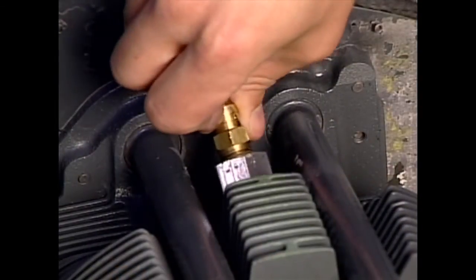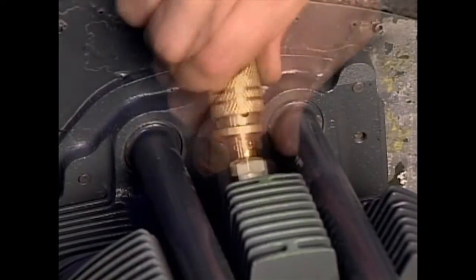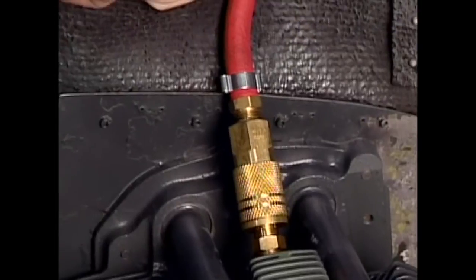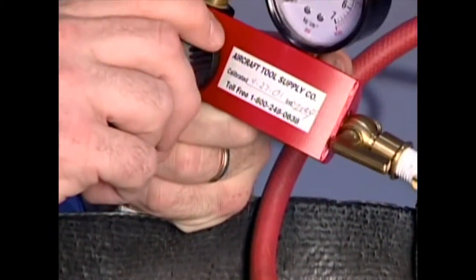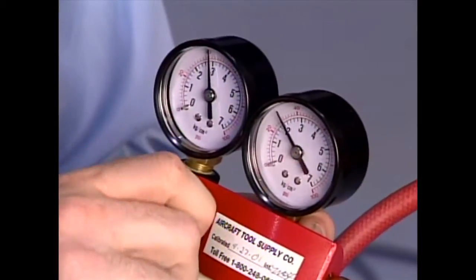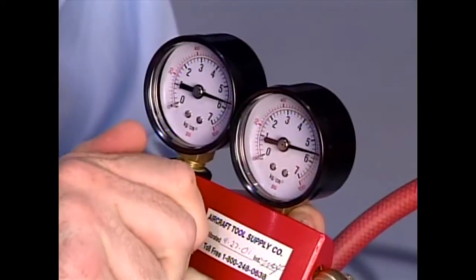The differential pressure tester measures leakage from the cylinder through the valves and past the cylinder rings at a point in the cycle when the cylinder should be sealed. Air pressure of 80 psi is fed into the cylinder, and the cylinder is checked to see what pressure it will maintain using a calibrated device. A result of 60 to 80 psi is generally considered to be acceptable without further investigation.